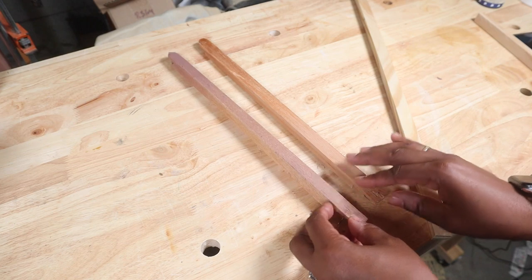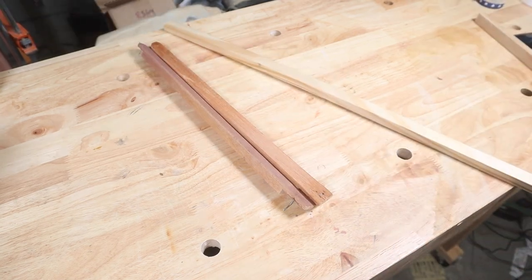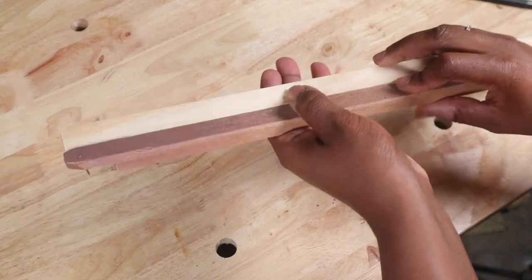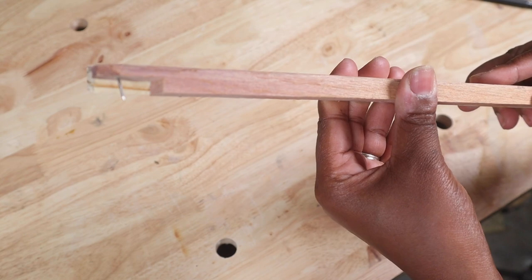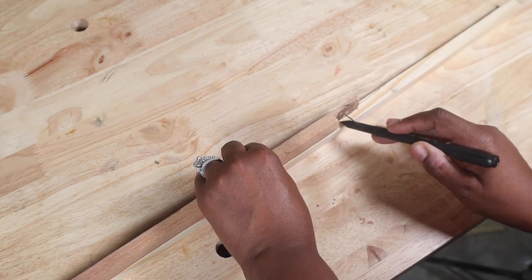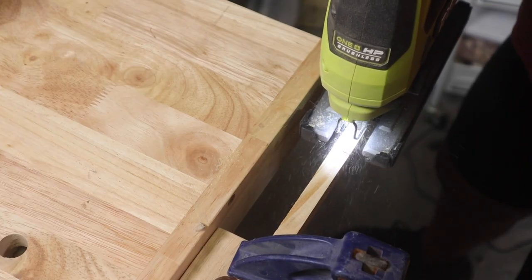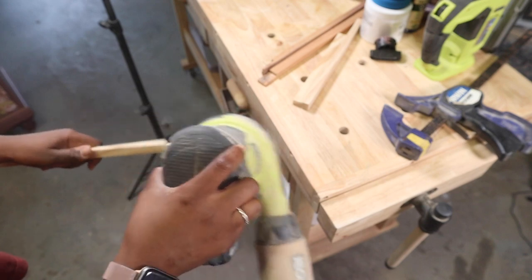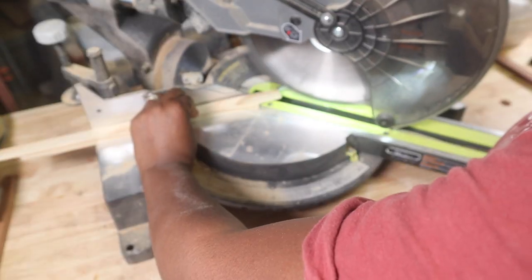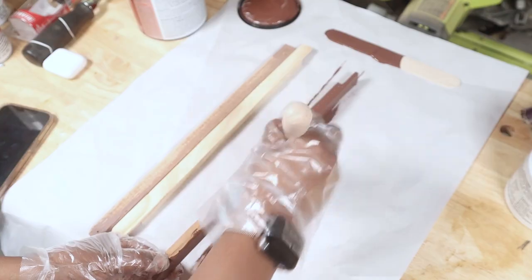Next was the drawer tracks. Two were fine but one was missing, so I went to Home Depot and got wood of the same width and height, traced what needed to be cut, made sure the thickness matched, and cut the piece to length on my miter saw. I then used my jigsaw to cut the additional notches so it would fit. I also cut angled notches at 45 degrees on my miter for a cohesive finish.